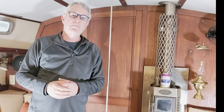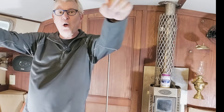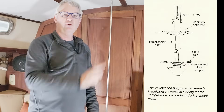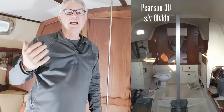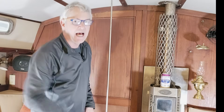In transferring these forces, the wires attached to the hull — the rigging — are attached to the chain plates along the sides of the hull. They tend to get pulled upward, while the mast is likely to transfer forces downward under the load. Deck-stepped masts often need structural support under the deck, which is the function of compression posts. The compression post would absorb the downward forces on the mast and prevent the deck from being damaged or failing under these forces. A keel-stepped sailboat is more solid, and the downward forces on the mast bypass the deck entirely and are transferred down into the keel.